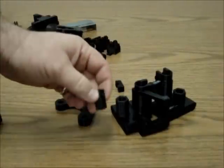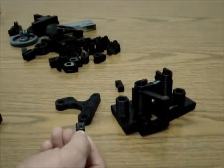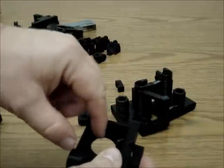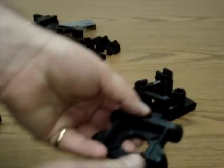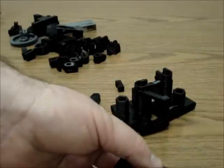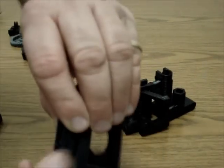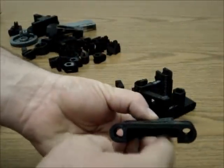These are rod clamps — I didn't change them. They bolt onto the Z motor mount. The problem with running the motors traditionally in the pockets is that it's sometimes a tight fit and the screws that go through have no space left to be longer. There's no room to tension it without hitting the motors. That's part of why I flipped these over — it adds no extra Z height, but I can run a longer screw underneath because it's far enough off the Z rod.